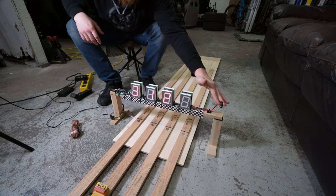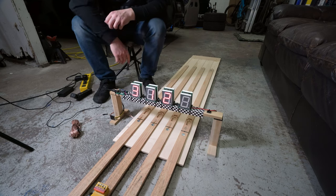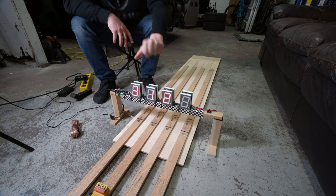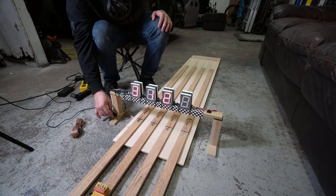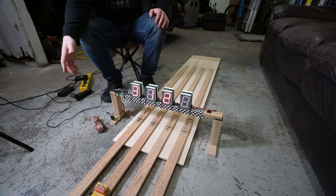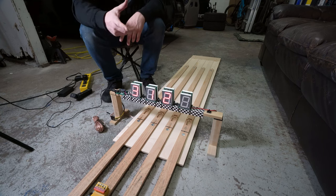So I can plug in 12 volts from that side or this side on this board, and then we have a reset button here, but you could also push the reset button on the Nano itself, and we have all of our displays. And then down here we have connection to the sensors on the bottom, and you can disconnect the gate sensor, or gate switch, and that's where, at the top when you drop the gate, that switch will open up.